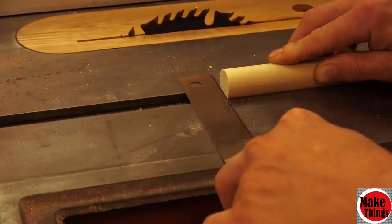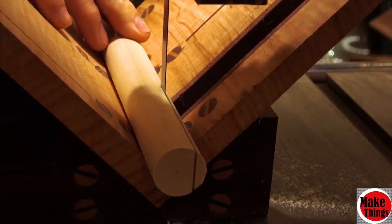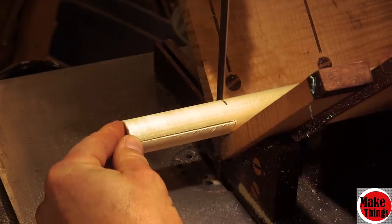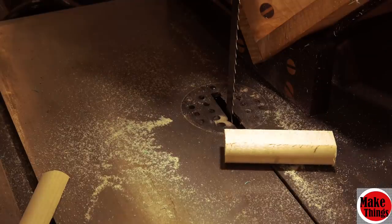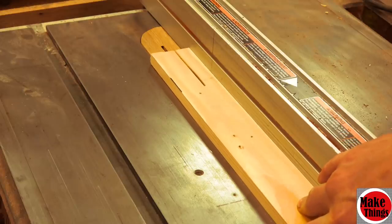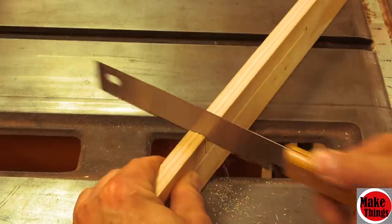As well as the rotating featherboard pivot, I needed a pivot on the table — a seesaw that will allow the jig the ability to be changed for each thickness. I can't tell you how thrilled I am using this bandsaw jig. Before I made it, putting a flat surface on a dowel could only be done on a belt sander, giving me an edge not entirely precise. I'm going to show you how I made an expansion bar. When I first started this idea I was only going to make a standard horizontal featherboard and use this video as a reference for future expansion bars.